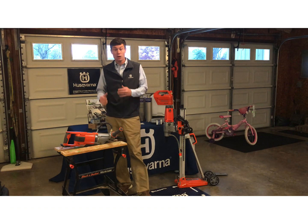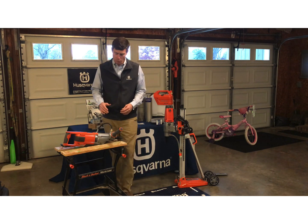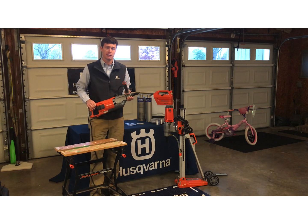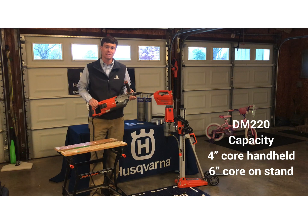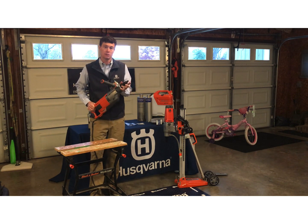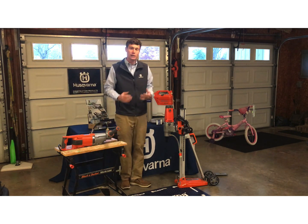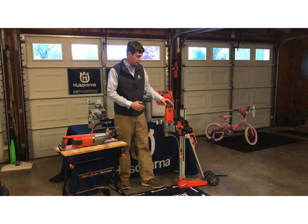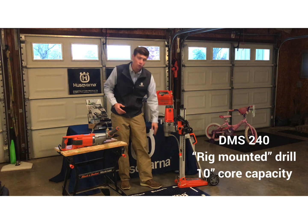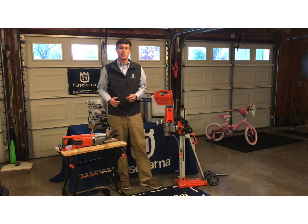Let's get into a little bit about core drills. We're not going to cover core drilling — we'll cover that in a different episode. What we're looking at today: this will be a handheld core drill, Husqvarna's DM220, rated for a four-inch core or six inches if mounted on a rig. The arbor is a five-eighths eleven, the standard for handheld core drills. The other type is a rig-mounted or stand drill — this is our DMS240, rated for up to a ten-inch bit, with a one-and-a-quarter inch arbor. That's the standard arbor size for core bits that will come into play with these accessories.